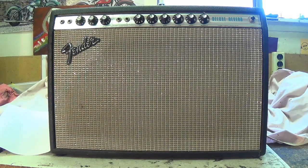Now, to properly evaluate this is very tricky and would require some sophisticated equipment to measure, say, total harmonic distortion and things like that, that I don't possess. But we did see that the crossover distortion did not seem nearly as evident at the higher bias percentages.